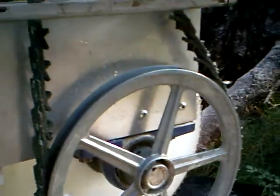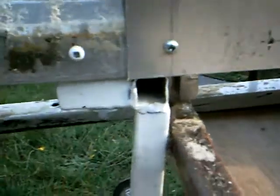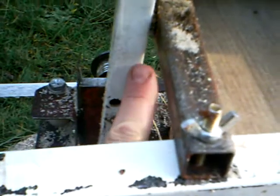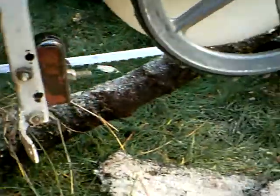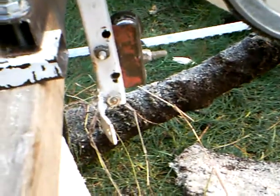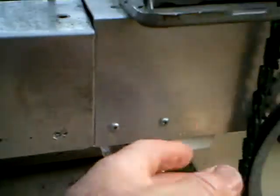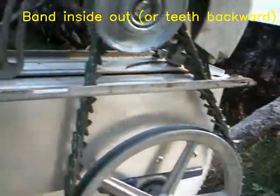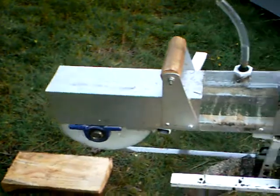And so, compared to last January, the whole saw has been turned around, because having the self-adjusting band guides, the posts holding all the band guides and other stuff were turned around. I just turned the whole saw around, so these were at the front instead of the back, and the pulley is now on the front, and the whole motor is on the left instead of on the right, which is probably an improvement.